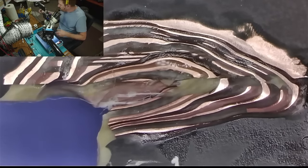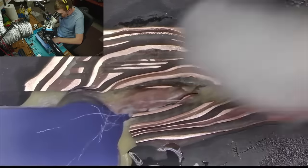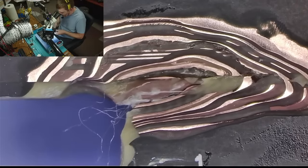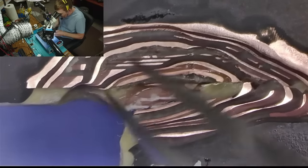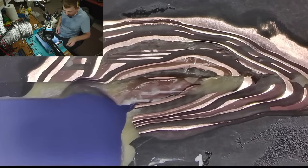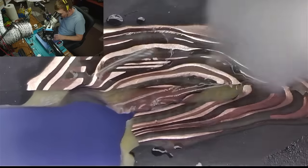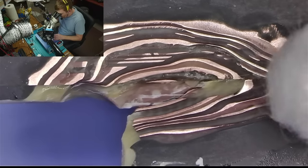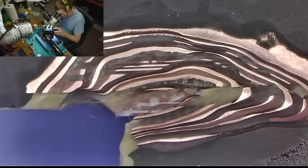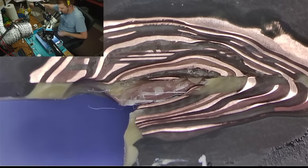And let's see, we might have to start with getting rid of all that greasy stuff, whatever it is. Clean up and... Oh, there's still more. That could be flux seeping through the fibers of the PCB. Something that's very unfortunate. But there's nothing I can do about it. We're just gonna have to squirt some alcohol in there and hope for the best. So let's do that.